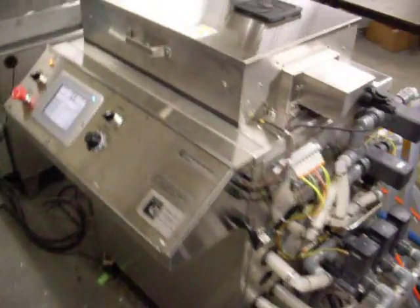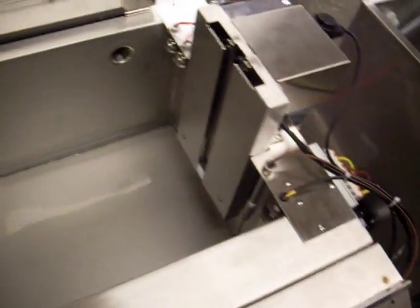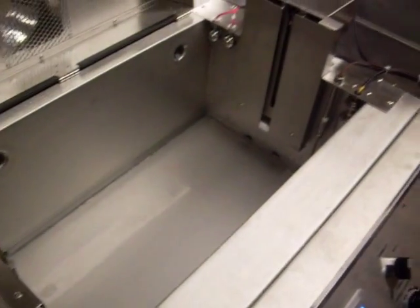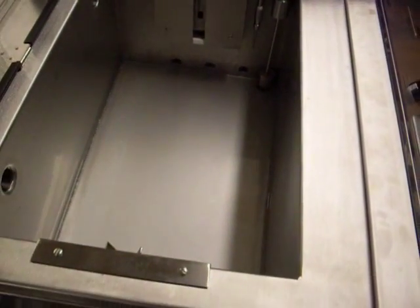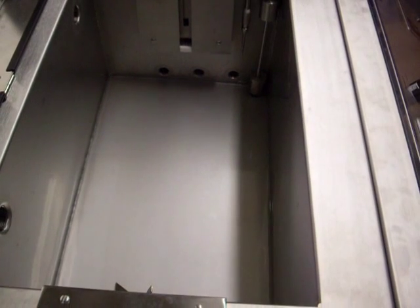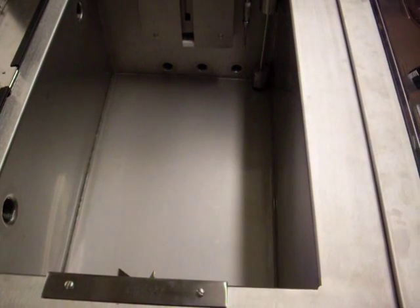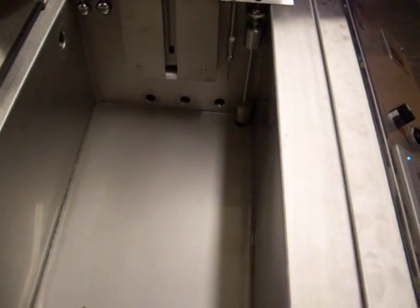The tumbler mechanism has on the front there a rheostat to slow it down or speed it up. Filling and draining is detected by an in-tank float, which is right there on the right-hand side. There's an upper float for filling and a lower for draining. We've drained here now. I'll go ahead and try to get a close-up on the drain float, which is a hooded float, so that you don't come in contact with it. So the float is inside that round hood shield.